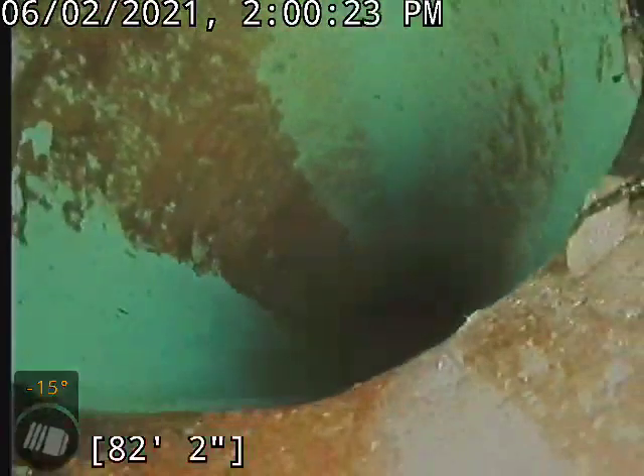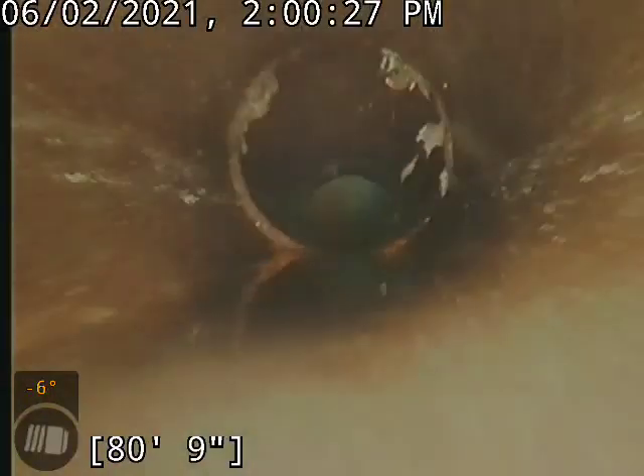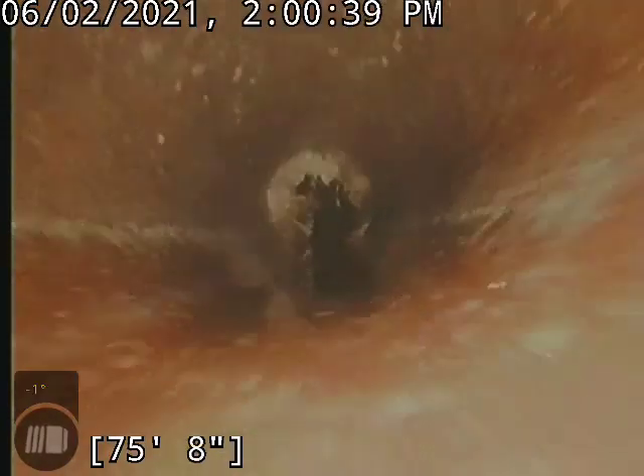About here where it's getting all jumpy — about 82 feet. We did have quite a few roots throughout the line. There is pretty much 100% blockages at a lot of the joints, as well as 45% blockages in spots.